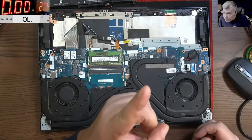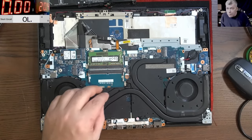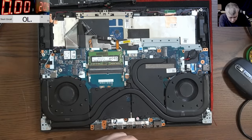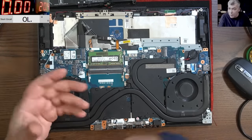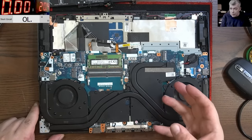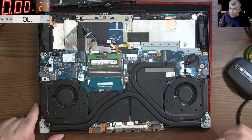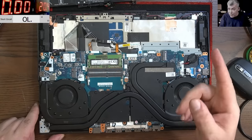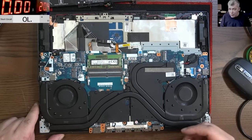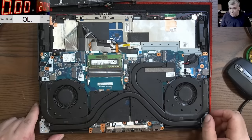Via the keyboard connector. That's very important. In this case, on the front of the keyboard, you have another ITE chip, because this has some backlight and has to be fast. It's a gaming laptop. And the chip could not be programmed via the keyboard connector. So you have to take out the chip and put it into the programmer. If you ask about soldering wires, that's what I did in the video from before. I soldered wires and it didn't work. I got some errors, because probably it was soldered on the motherboard. So, yeah.